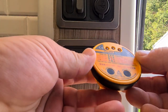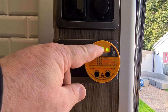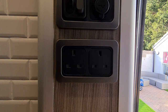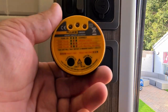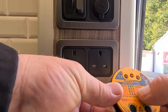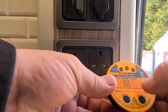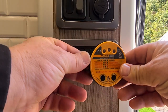This is a plug top tester. I recommend you buy one and stick it in your van. It's ideal for when you pull onto any site — you can just plug it in and it will tell you if everything's wired correctly. Three green lights means it's correctly wired. A red light in the middle means you've got a missing earth. Two red lights to the right hand side means you've got a live earth reverse. Two red lights on the outer extremities means live neutral reverse. This one also has another function — it has just tested my RCD.